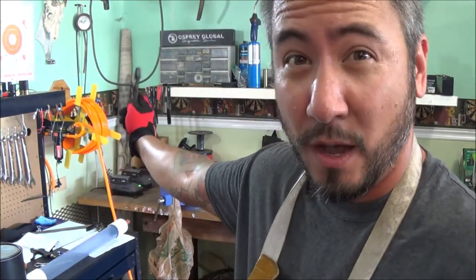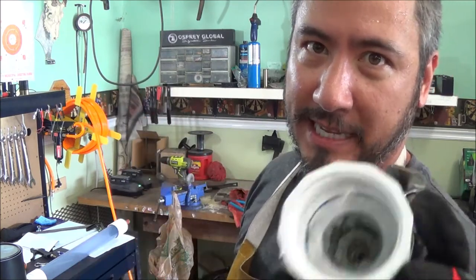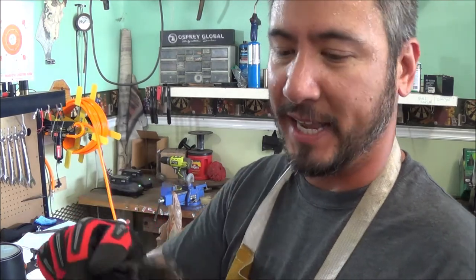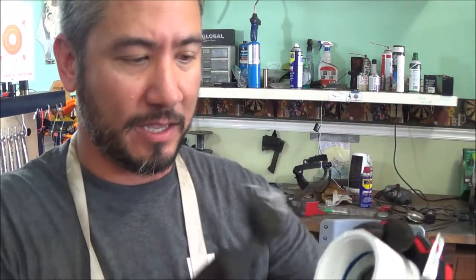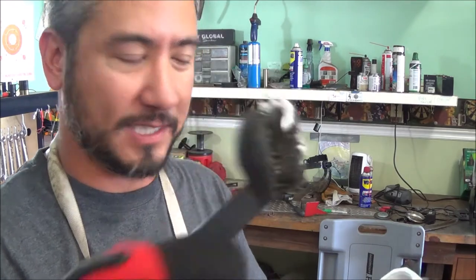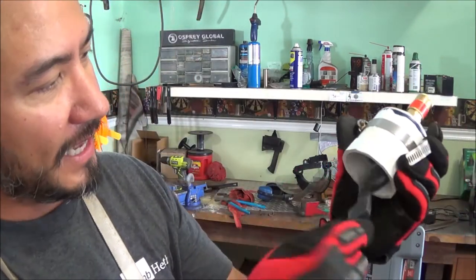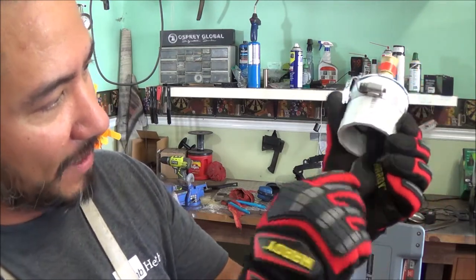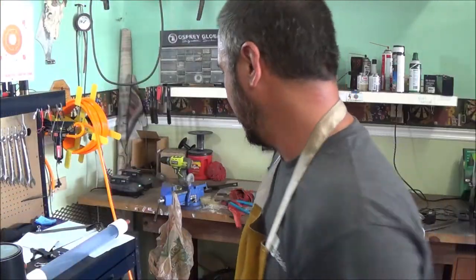And I've also got a water separator and filter after this just to catch any little particles so those don't go to the tools, especially when I get to painting. Now, since this is PVC, each time that you change it, you will want to change out your plumbing tape. So as you can see there, I just take a little wire brush, real lightly just go inside the threads. That takes that PVC tape right off of there, or the Teflon tape, I guess is what it is. And then you can put more on.